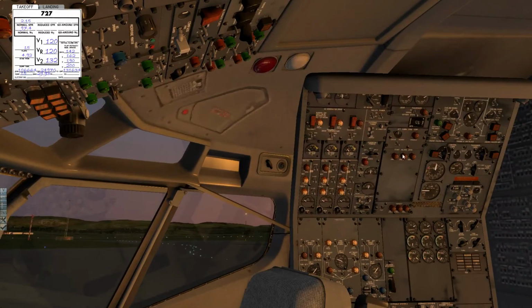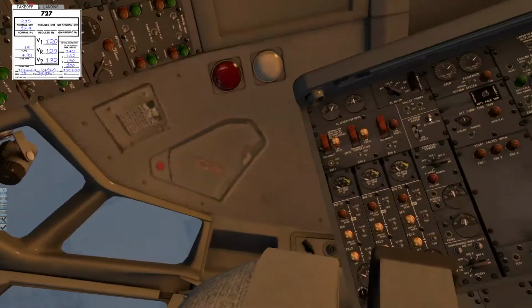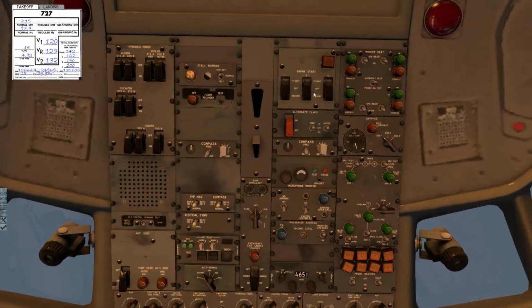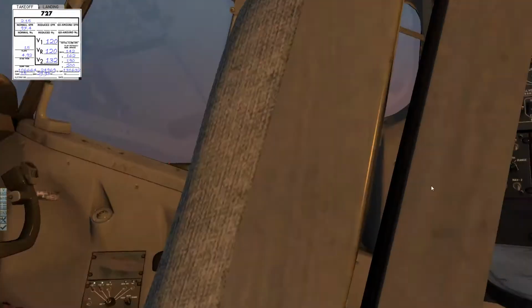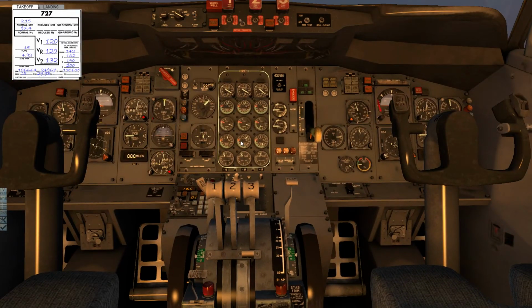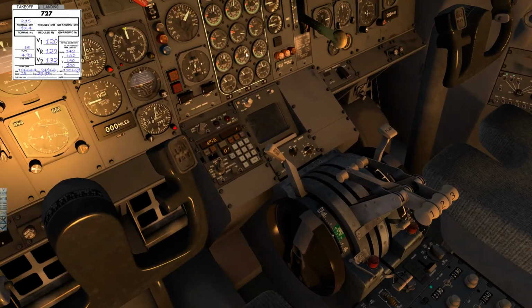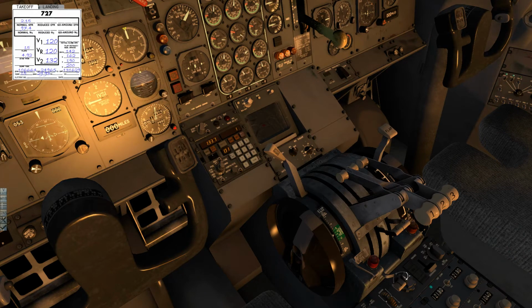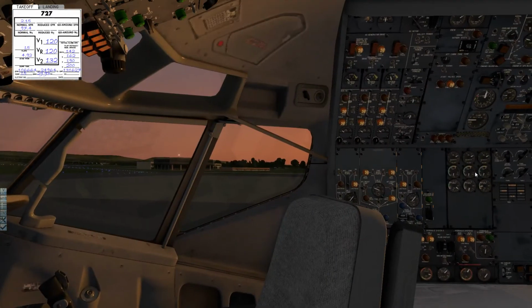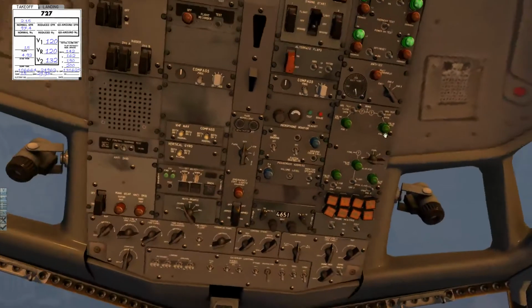You hear that click, the start valve's closed. That means normally we'd wait for that engine to stabilise, but as the start valve's closed, we're back to 30 psi, we can start number 2. Start valve's open for number 2. N2 is turning, still pushing back. There we go, 20%. Introduce the fuel. Look up here. Now the start valve is closed and we can start number 1.